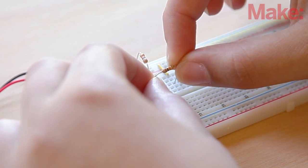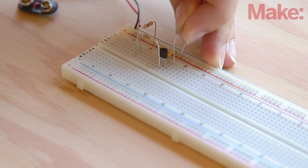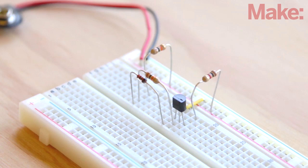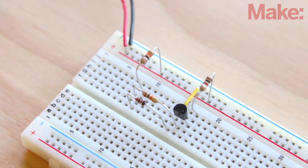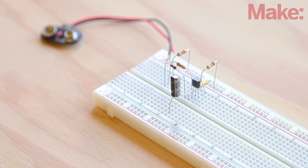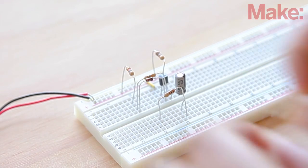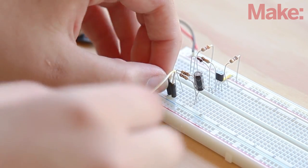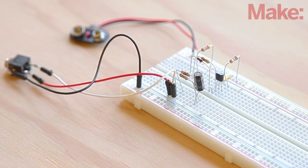Insert the second 10-kilohm resistor connecting the first resistor to the base of the transistor. Connect a 1-kilohm resistor from the power rail to the transistor's rightmost pin, the collector. Then connect the diode from the two 10-kilohm resistors to the leftmost pin of the transistor, noting its polarity — the diode's black stripe should be nearest the transistor. Connect the 10-microfarad capacitor from the base of the transistor to the other side of the breadboard, noting the polarity. The positive side, without the black stripe, should be connected to the transistor. Connect two 100-ohm resistors to the negative leg of the capacitor and insert their other legs into two separate rows. These are where the left and right audio inputs will connect. Use alligator clips to attach jumper wires to the three legs of the audio jack, or you can solder them on directly. The ground goes directly to the ground rail on the breadboard. The other two pins are for the left and right audio inputs — connect each one to one of the 100-ohm resistors; it doesn't matter which.